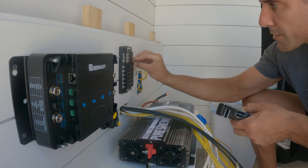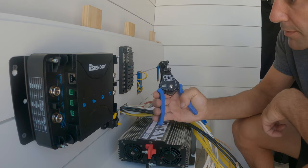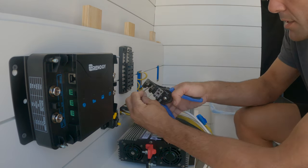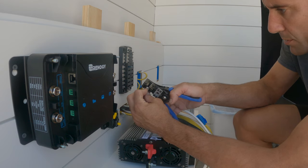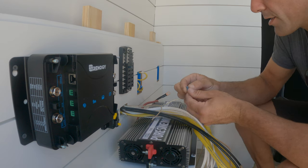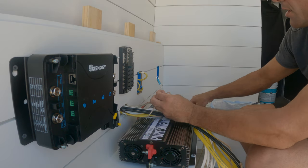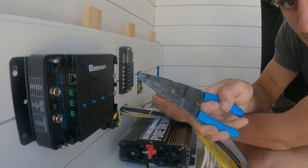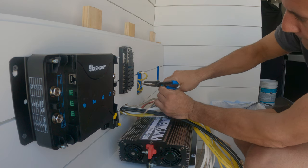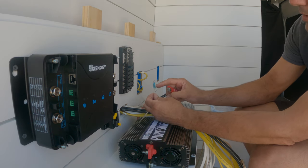I've cut the negative down to exactly where I want it, so now we just have to strip the insulation off. If you don't have one of these Klein wire strippers I'd recommend getting one — I'll put a link for these. It works so much better than the cheap wire strippers. Just line your wire up where it goes and pull it — strips it perfectly every time. Now take one of the terminal connectors, stick the wire in, make sure you get it inside the little hole. Then take a normal crimper — these are good for crimping. Nice crimp, check your connection to make sure it's not pulling out, then take your lighter and melt the heat shrink.